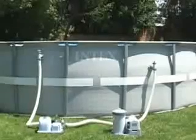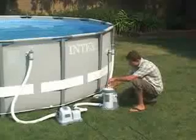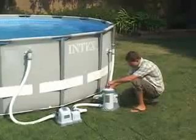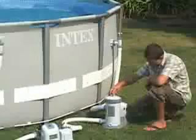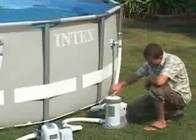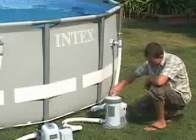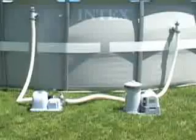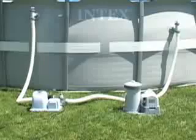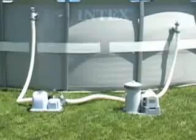Make sure the filter pump starts operating before the saltwater system starts its daily operation, either with a timer or manual operation. You should also turn off the filter pump after each chlorination cycle or boost cycle is complete. Proper filter pump maintenance, including regularly replacing the filter cartridge, is vital for the saltwater system to function properly.